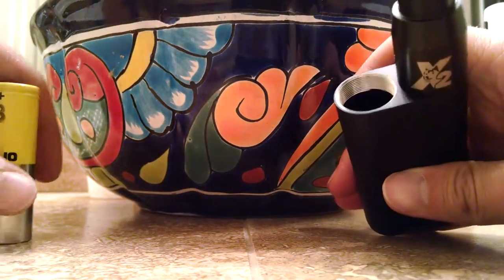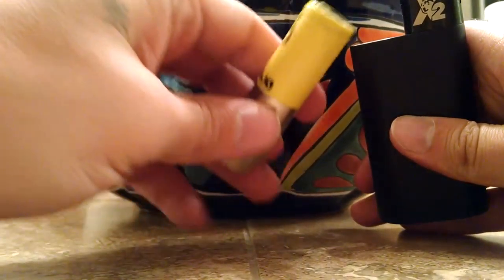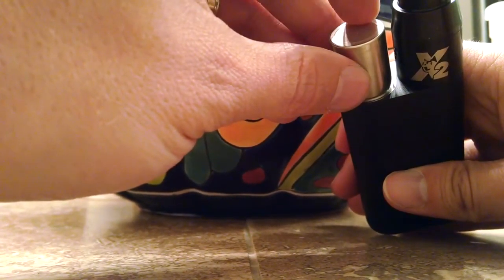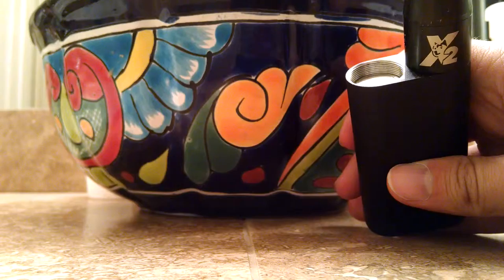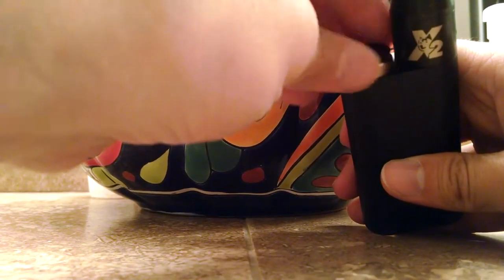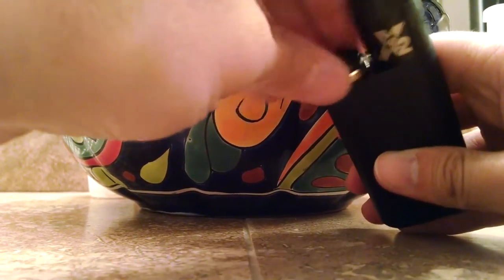That's all. Now, on this side, remember this side was positive up. Positive up is going to touch your atomizer. This side, positive goes down. These are in series, okay? You throw that in. Take your switch, thread it on. Here once again, a little crunchy, but we'll throw it around as far as she'll go by hand.